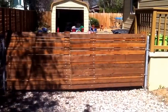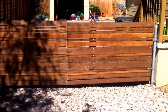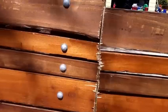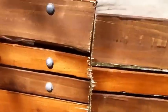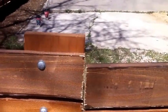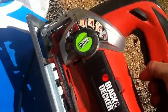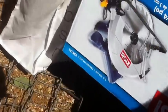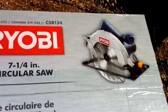Here's the almost finished product, but I've definitely got a mistake to show you — look how jagged this line is, it's completely uneven. That's what you get when you try to do the work at night and when you use a jigsaw. Use the right tools: you don't want to use a jigsaw to cut a nice straight line in a fence because the blade will just wander around.